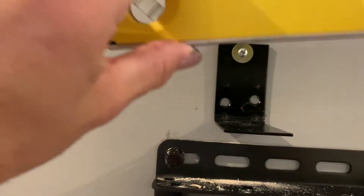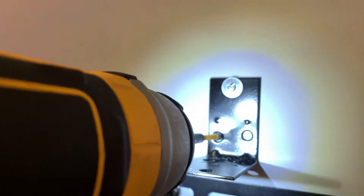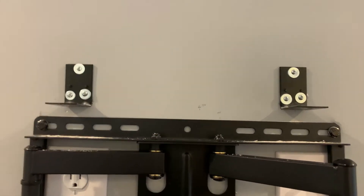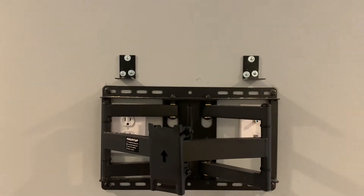I'm going to pull it off the wall and mark my two screw holes in the back, then put the other two anchors in with it hanging on the wall. I rotated my brackets inward so I didn't scratch the paint outward, then put the other two anchors in at the bottom and tightened those up. So now we're ready to put the One Connect above the mount.